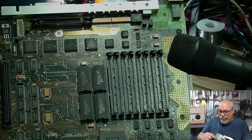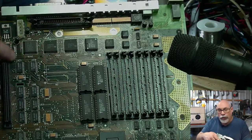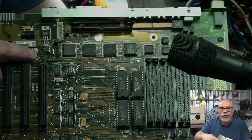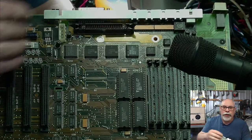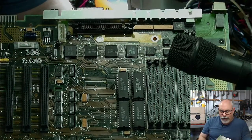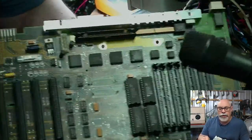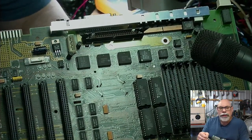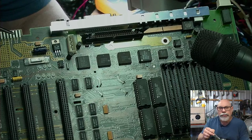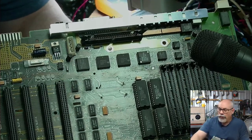So what I am going to do is I'm going to inspect this area here and leading along here. You can't see it because it's off the camera, this is where all the startup circuit stuff is. So we need to check and make sure that all the traces leading to here are good. There's often with these also damage around, I'm running out of room, God, these boards are big. There's often issues around here and then leading up to these little test thingies here. It doesn't matter if any of these traces are broken because we don't need this thing here, but I better zoom out.